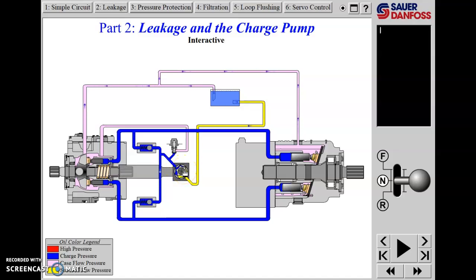The size of the charge pump is generally about one-fifth to one-tenth the flow rate of the main piston pump in the hydrostatic drive loop. It's a comparatively small fixed displacement pump, designed to pick up whatever the maximum case drain flow we expect at any given time, plus a little extra reserve for pump wear over time. Anything it doesn't need to replenish goes over the charge relief valve, into the pump case for flushing, and back to the reservoir - circulating on its own at 200 PSI.